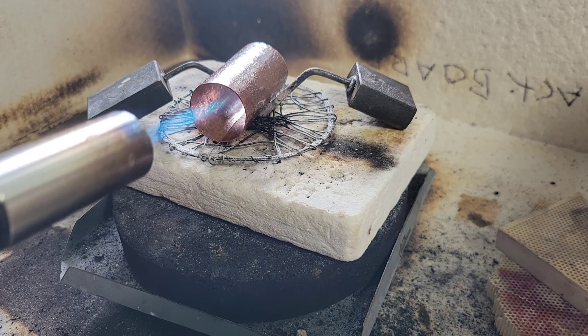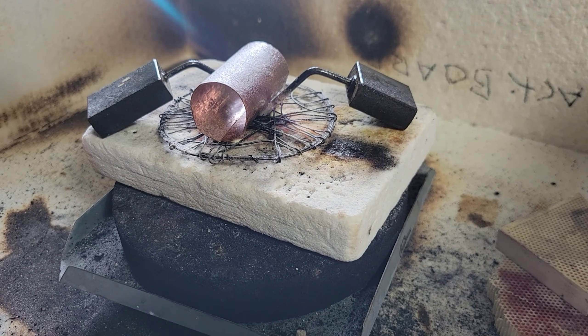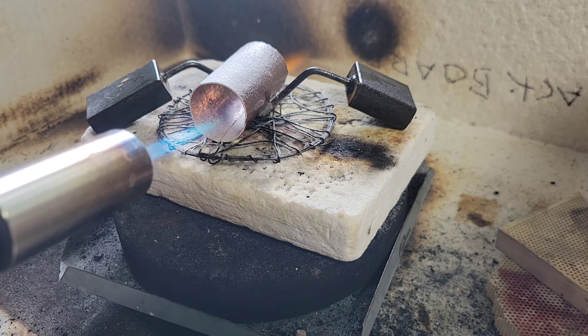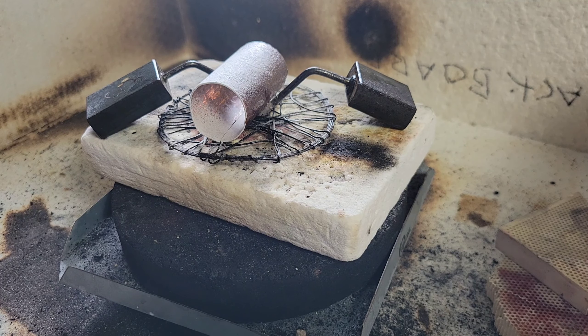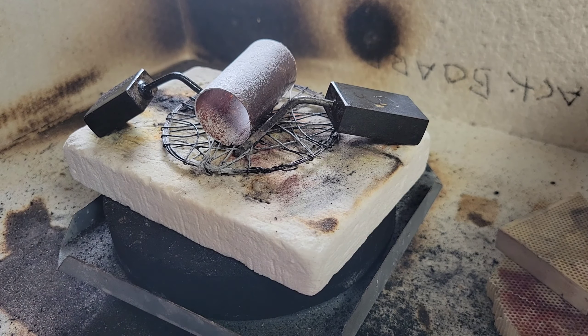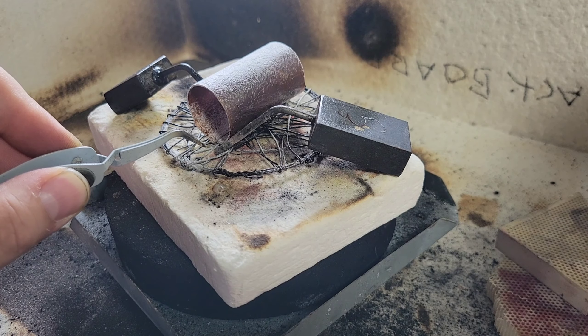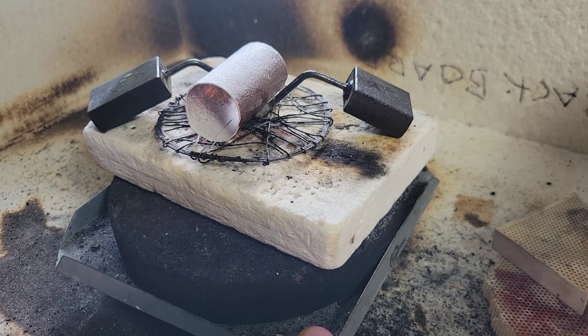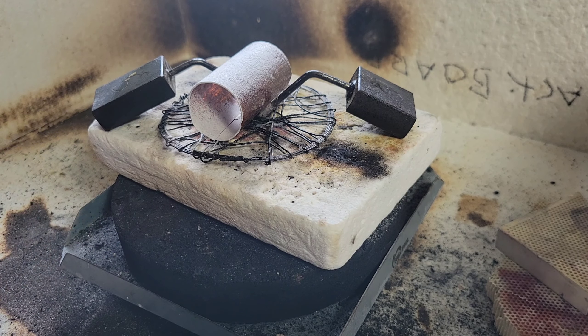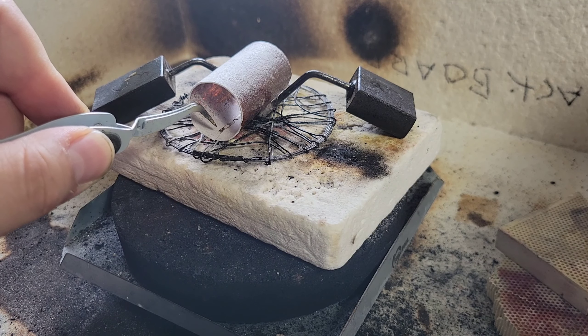Here's what we've done — we've set up our soldering station. We're going to preheat the metal so that when we spray our flux on, it does that cool foam thing. You see it turns white and we get the entire piece nice and warm. Those little squares with the arms are called hummingbirds, which is particularly cool. We've got some insulative stuff on our lazy Susan of doom here. I'm spraying inside where we're going to place the solder along the seam — flattened-out medium silver solder. We're going to try and slightly angle them diagonally across the seam in a little mountain pattern so that they fill in nicely. They come in a wire and we put them through the roller just to flatten them out — they are very finicky.